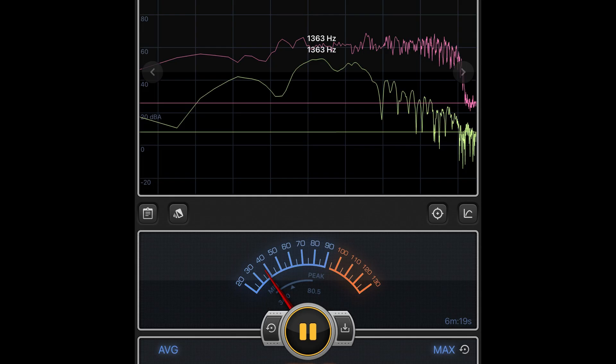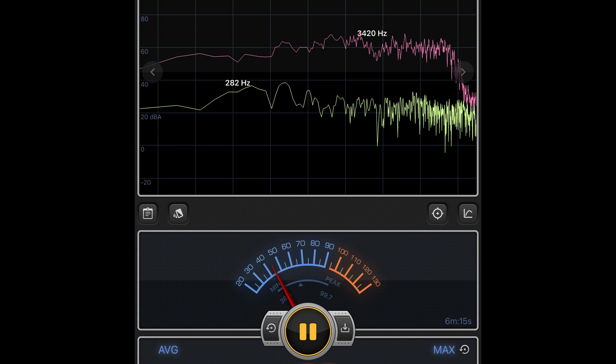I've been playing around with both of these using an existing crossover that works with the Scan-Speak, just plugging them in. I am using the LTCH voicing — the LTCH equalization circuit that drags down the midrange and extends the highs. This is a 16-ohm driver; the JBL is an 8-ohm driver. I'm using the same stuff — it shouldn't work well, but you can see the results: pretty flat and extended response with the JBL. It's too high and needs to be padded down, but the response is pretty good. The LTCH also shows a pretty good response and also needs to be padded down.